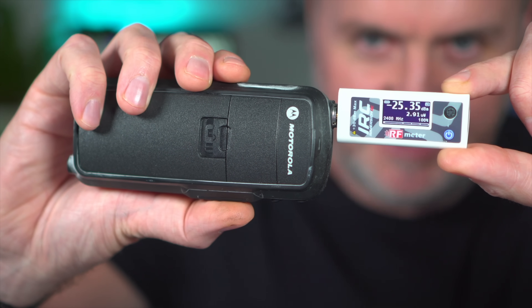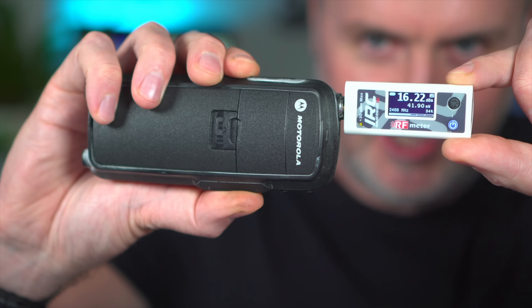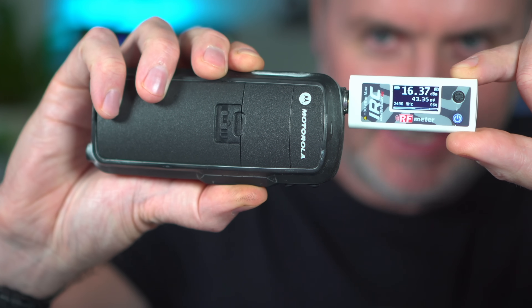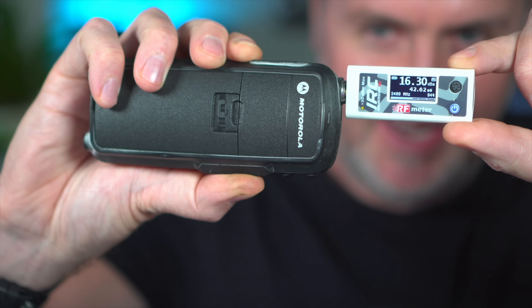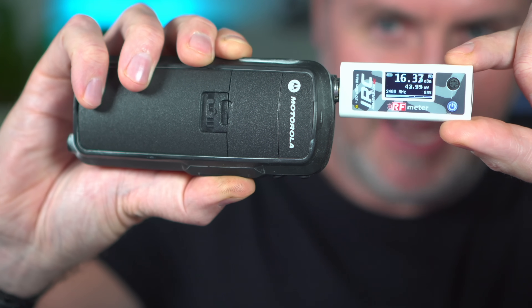Here's the power meter connected to it, configured to 2.4 gig. If we key up, we're showing about 42 milliwatts, which as an averaging factor is probably about right. These things are supposed to put out about 100 milliwatts, but of course it is spread across the spectrum so you're probably not going to get that reading. But even so, 50 milliwatts if it was that would still be pretty useful. So these little radios are super stealth — they're just interweaving between the 2.4 gigahertz Wi-Fi band and no one's going to notice they're there. It's going to be very difficult to detect these radios.